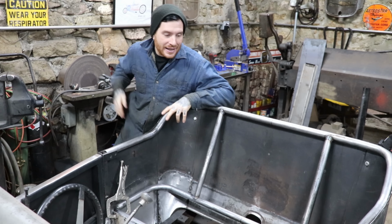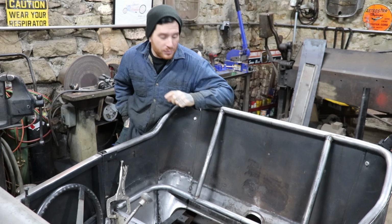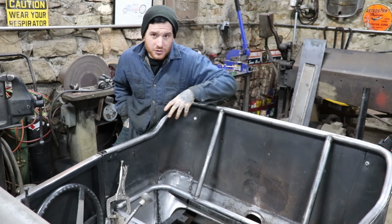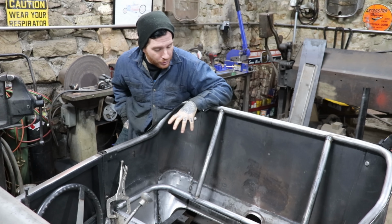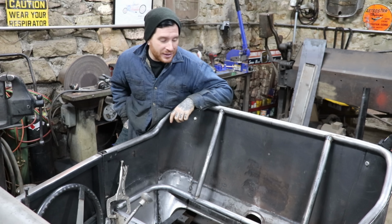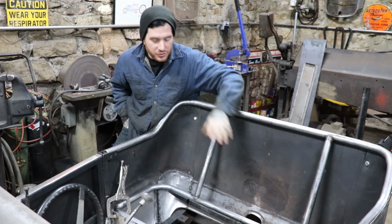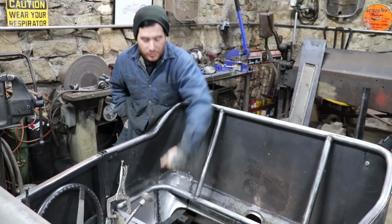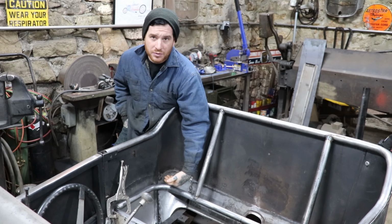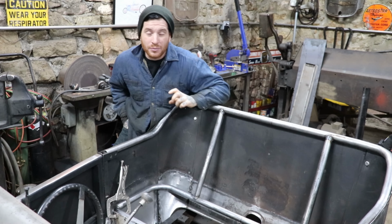The reason I did that is this gets the seating position where we want, number one. Number two, we brought it just above the rear notch in the body, so the torque tube is going to fit right in there really nice, but we don't have to build a little hoop in the actual seat section. So the seat's just high enough that it's gonna clear and a torque tube will fit underneath, which is really nice. But what that did was lift this bar, and the distance between the body mount and the actual tab on the frame is a little bit bigger now.